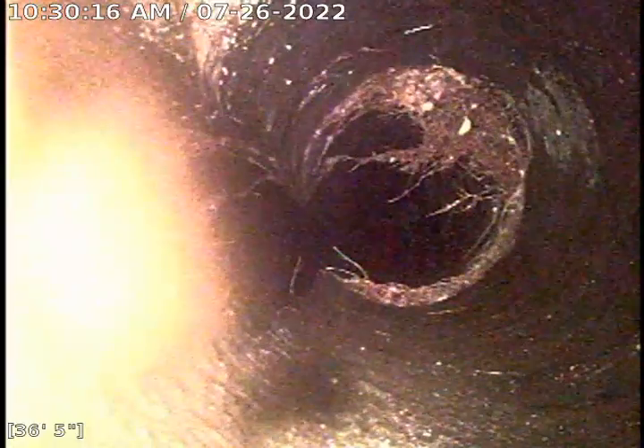So here's some residual roots. We were able to remove about 85-90% of this with our 2 inch blade. The first root intrusion we see pulling back is at 37 feet. Past that there was nothing obstructing the line.